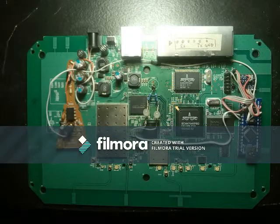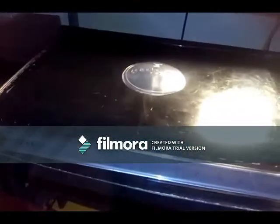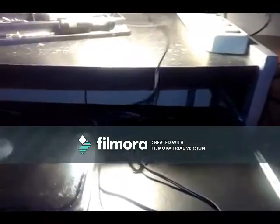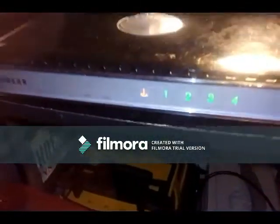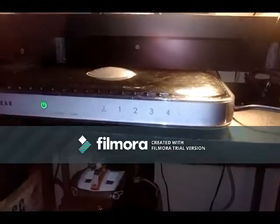Here on the right I got the Arduino, and on the left I got a 12V to 5V converter, and I got some LEDs in the center. And I got a level converter that converts from 5V to 3.3V because the Broadcom CPU uses 3.3V — I don't want to burn it. So I installed a 3.3V to 5V converter because the Arduino uses 5V and the Broadcom CPU uses 3.3V.